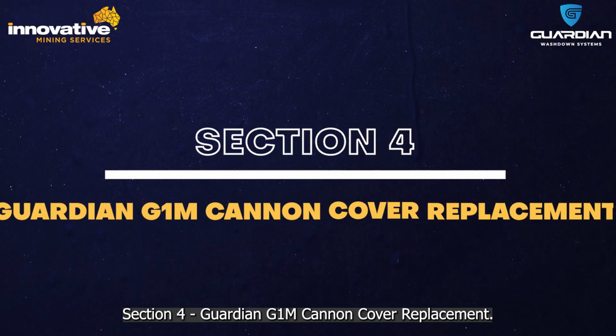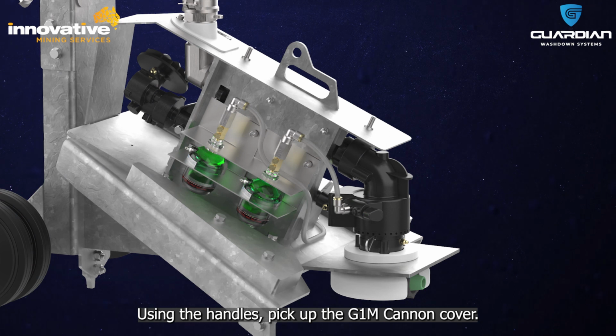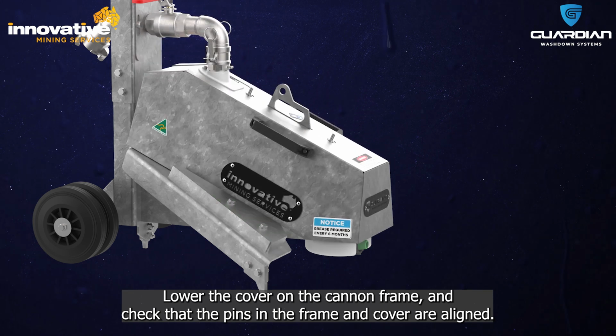Section 4. Guardian G1M Cannon Cover Replacement. Using the handles, pick up the G1M cannon cover. Position the cover with the cutout facing away from the cannon nozzle. Move the cover towards the cam lock fitting. Lower the cover on the cannon frame and check that the pins in the frame and cover are aligned.